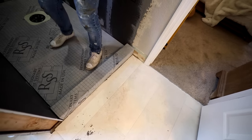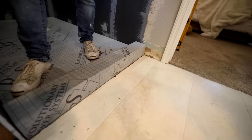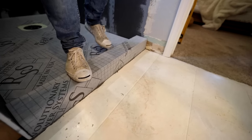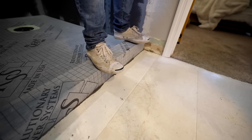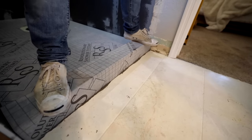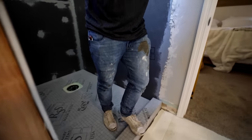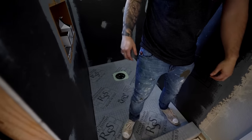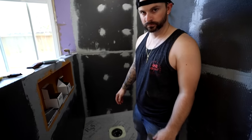And then we'll have to stand on the curb too and try to squish out any of that thin set under the curb. Yeah, maybe stand on it. Yeah, you see the thin set. Maybe go back and forth with it a little bit. Yeah, beautiful. See, it's oozing that thin set out. That's what we want. Yeah, with this, we'll get 100% coverage under this, baby. Yes. So, good job. Foam pan is down. Right on, Eric.